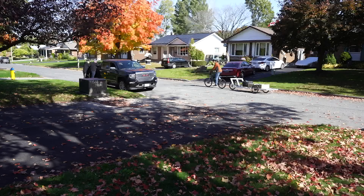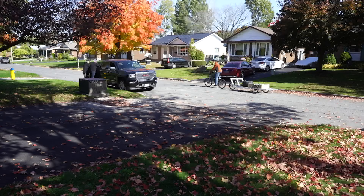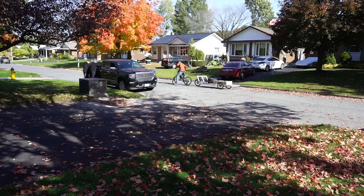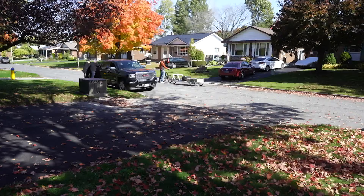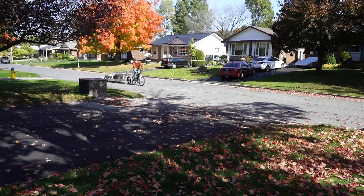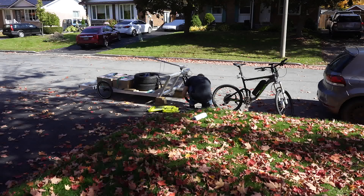Right away I'm noticing some kind of grating sound. I'm thinking it's something to do with the controller or the hub motor itself, but it's actually the cable that goes into the motor — I've got it twisted around the dropouts and it's rubbing, potentially doing damage to the cable. My solution was to just keep going and see if it goes away — a high-performance strategy I apparently learned rowing in the Olympics with Team Canada, where my coach used to say just keep rowing and your body will recover. Sadly that philosophy failed me here, so I've come to my senses, taken the wheel off, fixed the cable, and am starting again.